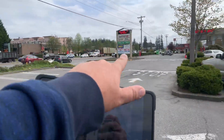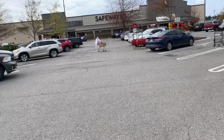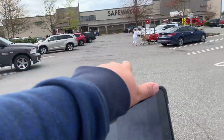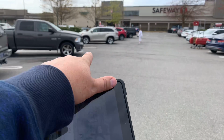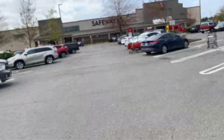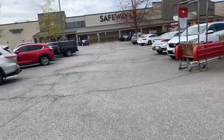So from the entrance, take a right, take immediate left. You've got asphalt repair to do basically in this entire drive aisle. You've got some sporadic cracking right here, and then you have a lot of it down that drive aisle. So instead of doing just that section and leaving this small area, we would go from curb to curb and do this entire drive aisle all the way through out to where it meets the main entrance out here on the road.